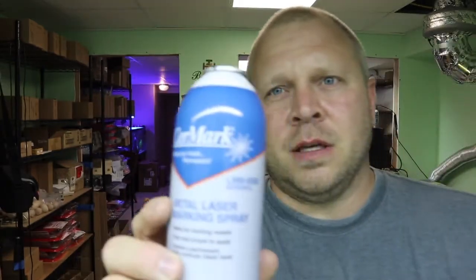That's how you fiber laser engrave onto a knife — either etching or annealing. Polishing isn't worth attempting on a curved surface. Etching is faster with the fiber, but for making a true black, annealing is the way to go on the fiber. Cermark is way faster for black marking — the LMM6000 saves a lot of time — but you have to spray it, which adds cost. If you can avoid that extra cost, you're better off with the fiber.